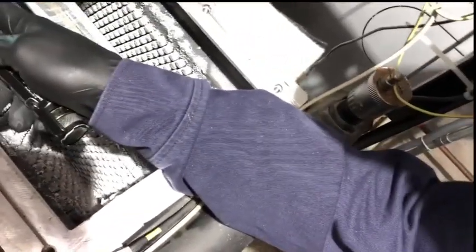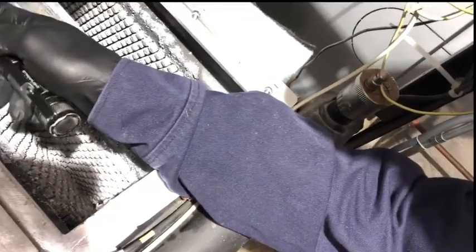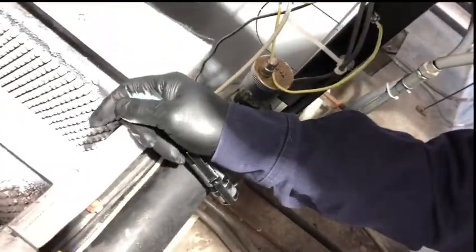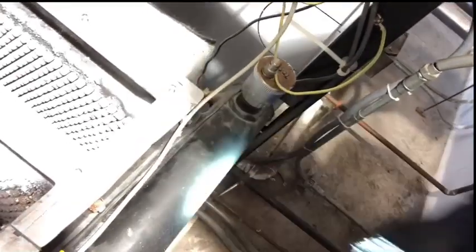And when you have these open, please clean those inspection windows on the other side, because you can take them off on the other side, but you don't have a seal to put them back on unless you reorder the seal. So clean them from over on this side. That way, nice and clean. You can look in and you can actually see the spark when the spark's operating. If you're here for a service call and you need to do a visual, that always comes out handy.